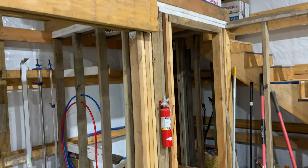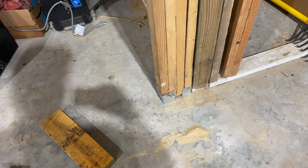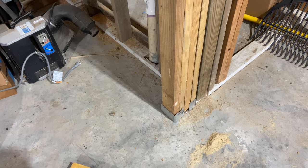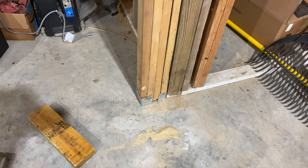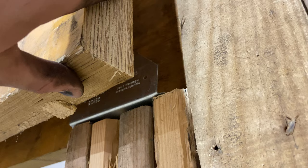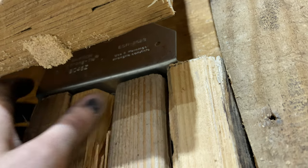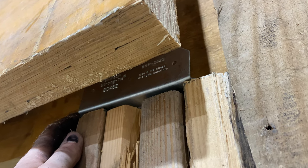They sent these brackets along and said to use three two-by-fours in the bracket. As you can see, I put four in there because it either fit four if I crammed them in, or it wouldn't fit three with any slop. These are like four-by-six post brackets. The lumber guy said use three two-by-fours, but the math didn't check out, so I made it work with four. On top I used another post cap — a two four-by-six post cap — and it didn't quite fit so I had to get creative to get it wedged in, bolted, and braced.